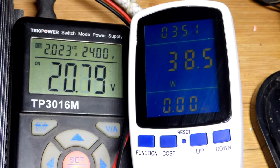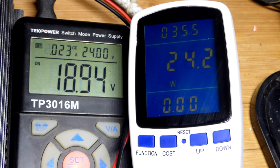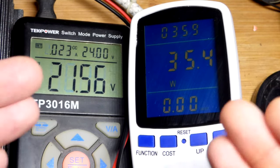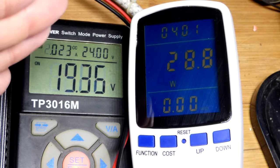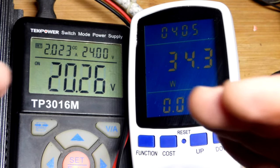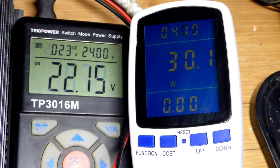You can't connect a regular inverter to an AC outlet, a grid tied outlet, because they won't line up when they're providing power. So when one wire is positive, the other one might be negative. That's a short circuit. Whereas they both have to be positive and then negative at the same time as they flip back and forth, each wire. Hopefully that makes sense.